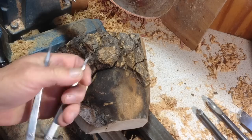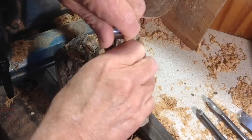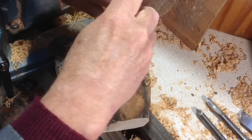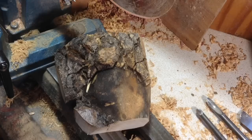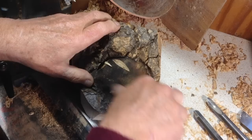So just find centre on this to start with — we'll get an idea of where centre is. Just take that out a little bit. I've got a steep side on the back, so to speak, from where you are. Yeah, that looks about right. Now I'm going to turn this on a two-spur drive, so I'm just going to put a V-groove in there for it to drive and sit into. And that will basically go between centres.